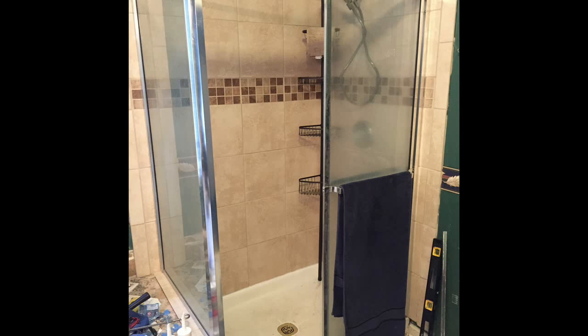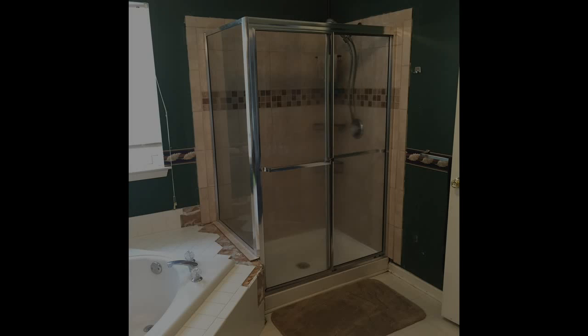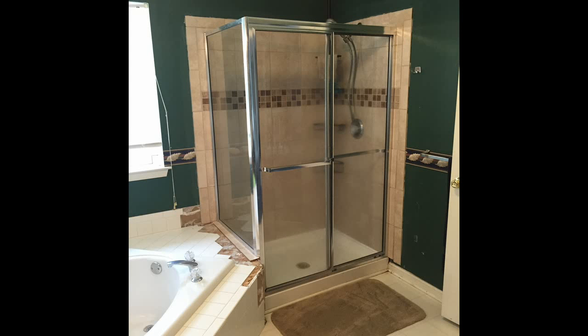I reused my shower doors since this was supposed to be a project on a budget — I really couldn't afford to spend money on new doors. I did reinstall the existing doors, and instead of putting a soap dish into the wall, we bought a floor-to-ceiling holder for soap dishes, washcloths, and shampoos. Here are a couple pictures of the finished product, and overall we're quite pleased with it. There are a few things I'll probably do differently, such as making sure the backer board is cut above the shower basin and not down over the seam — that ended up being quite a headache. But overall we're very pleased and I think it came out quite nicely.